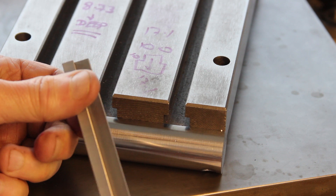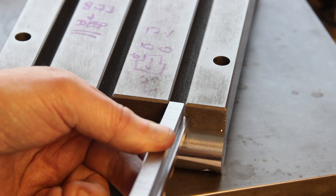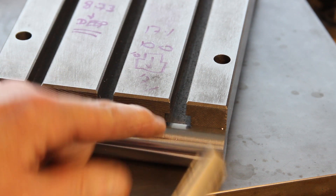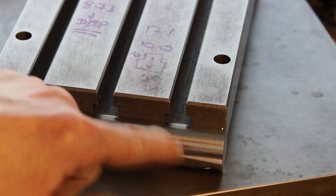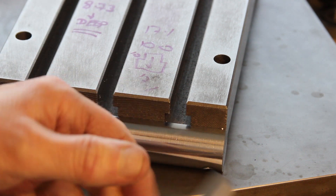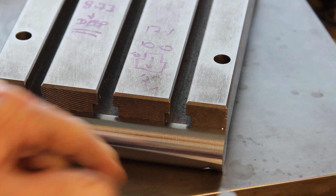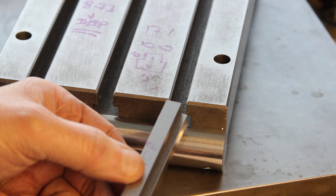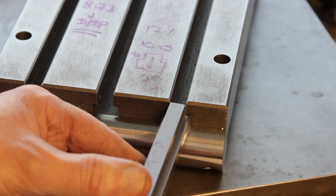There we go - that's the T-bar, if you pardon the pun. That's going to fit nicely in there. These round ends actually overhang the bottom of the T-slot. So I've designed this so that you have to take the bar off, insert them, then put the bar on, and they'll be retained - so I'll never lose the damn things, which is half the battle. I don't know whether that's a good thing or a bad thing, but we'll see.